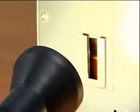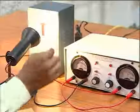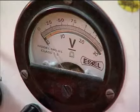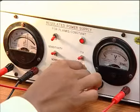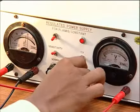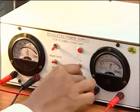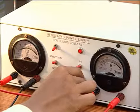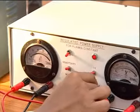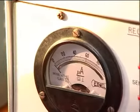Then the red filter is placed in front of the photocell and the deflection in the microammeter is noted. Then, gradually increasing the voltmeter reading, the corresponding microammeter reading is noted. With increase in voltmeter reading, there is a constant decrease in microammeter reading, and at a certain voltmeter value, the microammeter reading reaches zero.